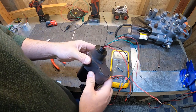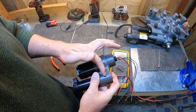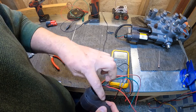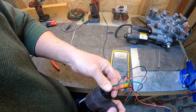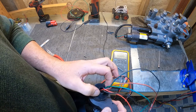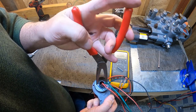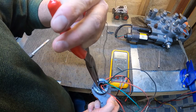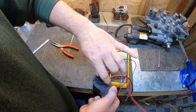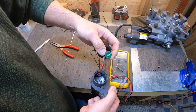All right, let's try to run through this flip style actuator. 3 main failures, again: motor brushes, potentiometer, and the bearing on the actuator itself. This is a weather tight marine style. Screw right here that we would take off to gain access to our wires. And then this cover right here is where our Hall effect sensor is. I choose some needle nose pliers, and we can loosen that up and back that off. Either some snap ring pliers or some needle nose pliers, and back this cover off. And then that'll give us access to our potentiometer.